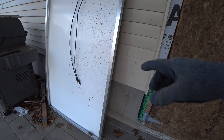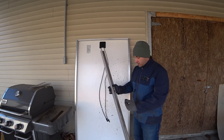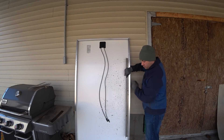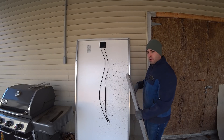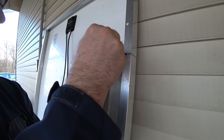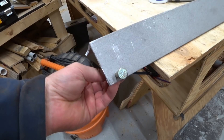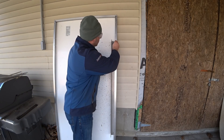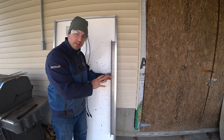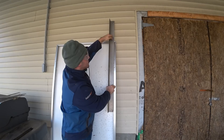I'm going to set up just a jig — just a bar — to confirm that. I grabbed a random piece of aluminum out of my pile that's a little bit longer than 48 inches. I'm just going to be lining this up, making marks with the Sharpie, and drilling these out so that I get exactly the right distance apart. I pulled a couple random bolts that just happened to have the right size shank and drilled some holes that are just big enough without much play. It lined up nicely — very, very little play in there. So I'm going to drill one more hole so I can put one bolt in here and then go to the next Z-channel over and leave myself a one-inch gap between the panels.